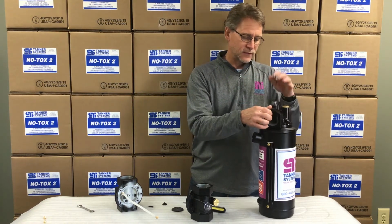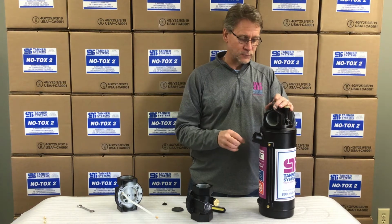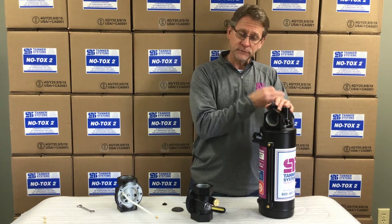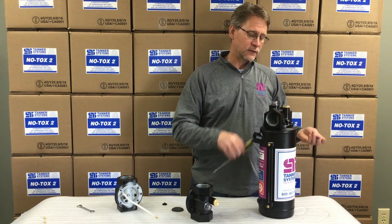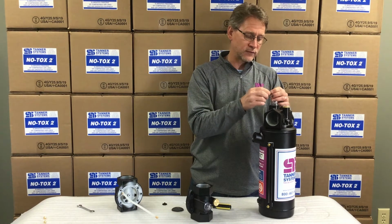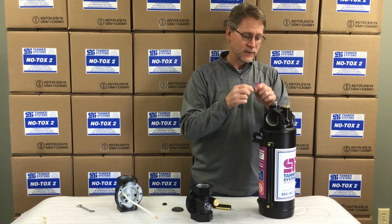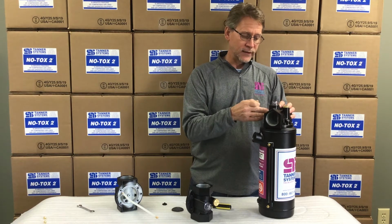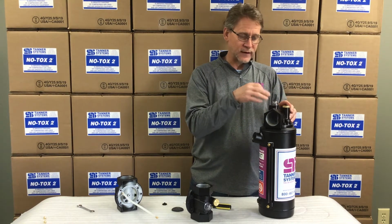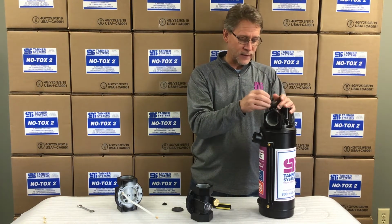If we don't have any leaks, and the adjusting screw looks like it's in good shape, we did talk about running it down to make sure that it was in the good position, but we should also remove it. We're going to want to turn the air off to do so, but you're going to want to remove the adjusting screw completely. On some of the dispensers, we need to remove the sight dome to completely take out the adjusting screw, but we want to make sure that the adjusting screw still has the tip on it. If your adjusting screw does not have a tip, it probably has been broken inside somewhere, and that'll render the top half of this dispenser inoperable, or I hate to say it, but useless. I haven't figured out how to fix that problem if one breaks off in there. If you have a properly working adjusting screw, put it back in, put your sight dome back on, and then